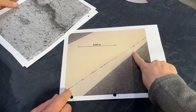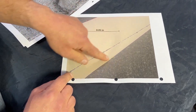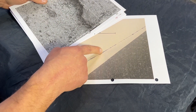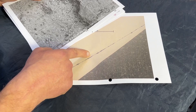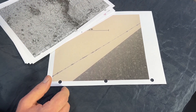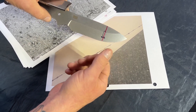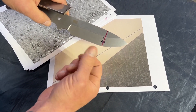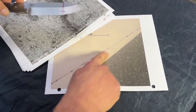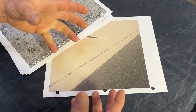It's some sort of material in there. What's going to happen now that they've gotten into this, they're going to zoom in really close like they did here and start inspecting that to see compositionally exactly what that is. But it's really, really soft and it's poorly bonded. And before heat treat, if I break into it on the surface grinder just up on the flats, it's just this kind of light gray, lead-ish looking stuff — and it's just poorly bonded. Then after heat treat, it darkens up a little bit, which you see it just looking — it's a higher contrast there. So whatever oxidized during the heat treat within that, it just darkens up.